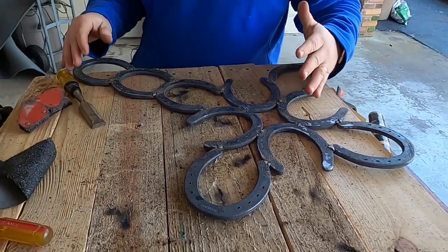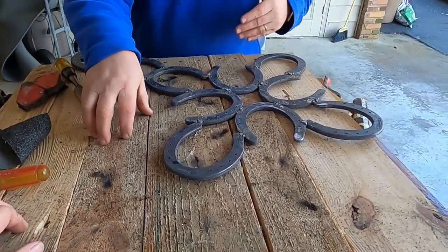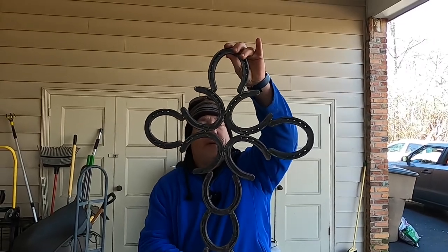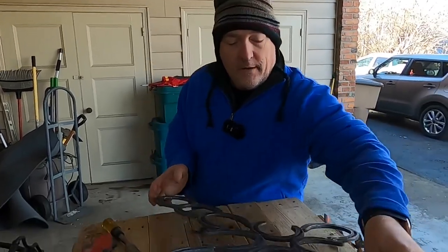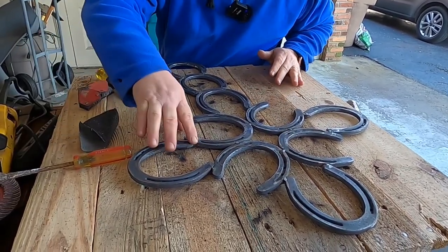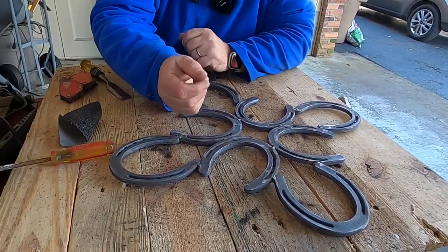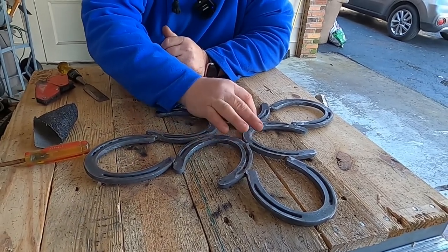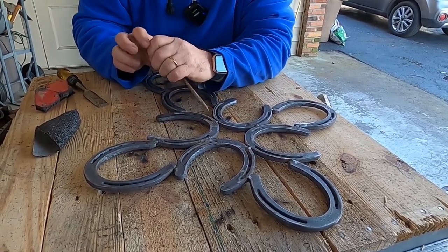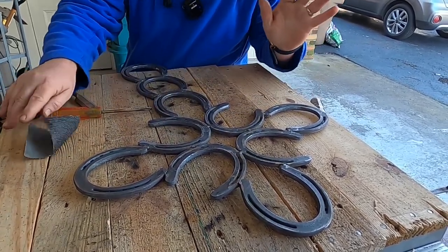You don't really need a welding table, although it is better. We did all the welds here. You always do a two-hand lift, okay, because it can still break. We ground it out, hit it with the grinder right here. You have this slag here — now if you're using a flux welder it's going to be nasty. If you have gas, it's not messy at all. You get your flathead here and you chip off the places, all this slag — try to clean it up best you can. Angle grinder, good sandpaper — hit it, take your time.